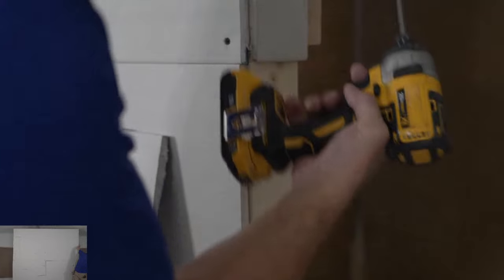On this side we're going to use vinyl corners. There are two types of vinyl corner: one is a rounded corner and one is square. I'll show you the difference because the drywall is actually installed differently for each type. The rounded one is called a bullnose drywall corner.